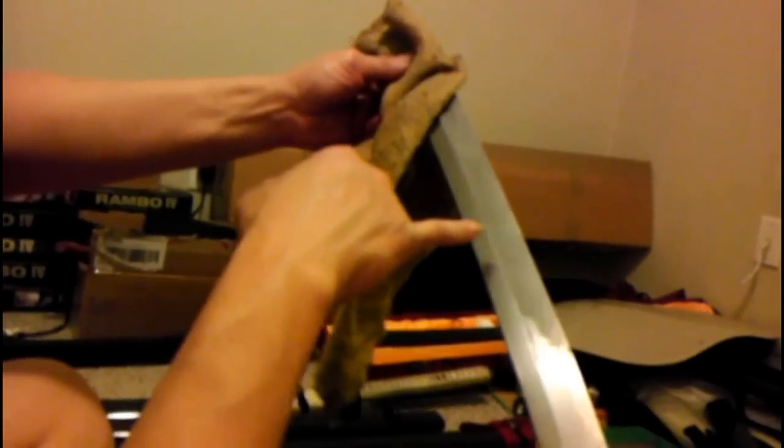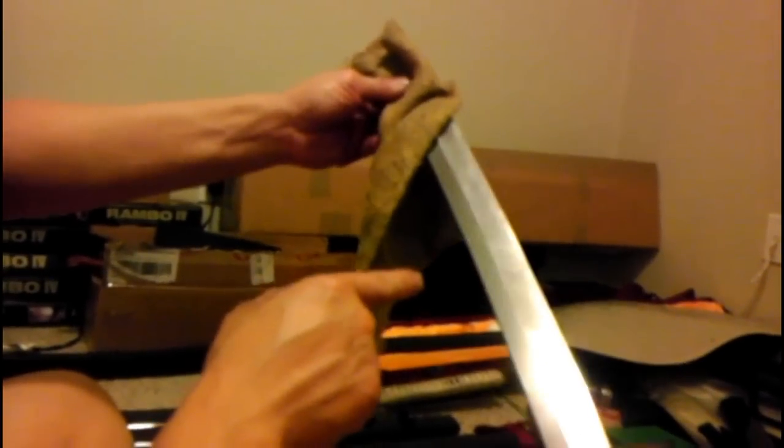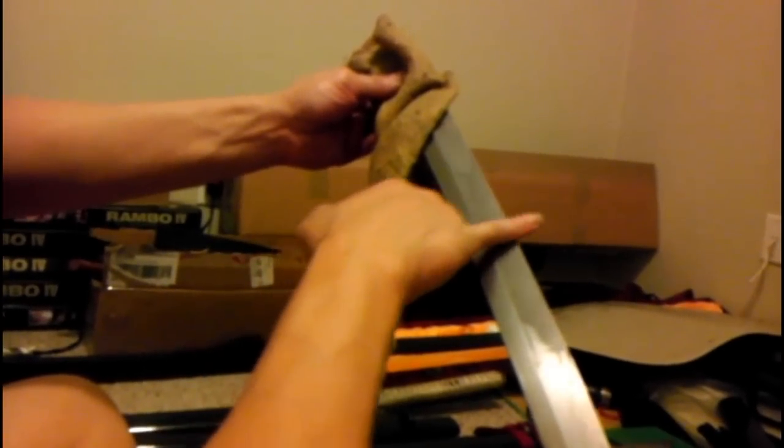A lot of times you'll see right at the edge there's a reflection. That's a roundness right there. Now you know the cutting plane is round. I mean, you can see it just by visually. But once you get to the edge, you can see it's still shiny right here on the edge. That means there's still an aggressive curve right at the edge. So this is what we're trying to eliminate. Completely no curve. Put both sides in symmetry to about 20 degree entry angle.